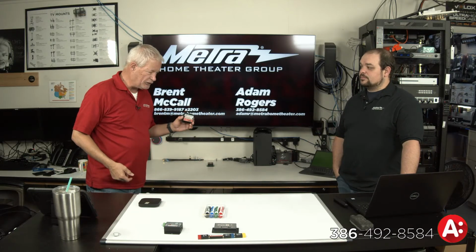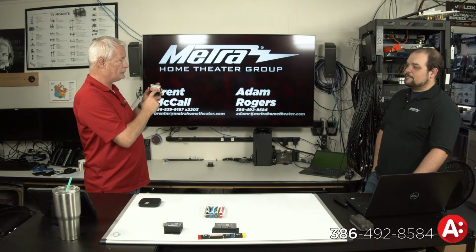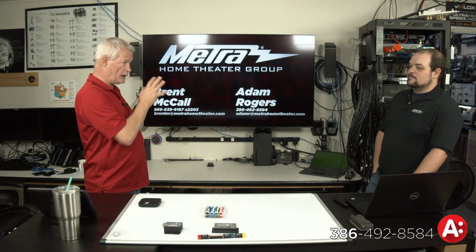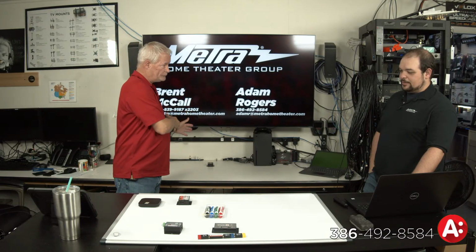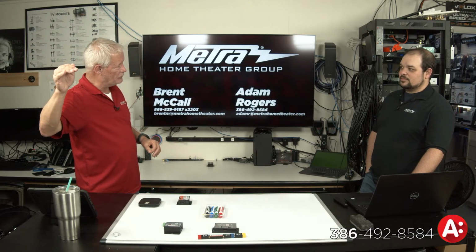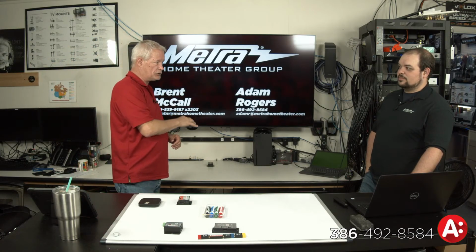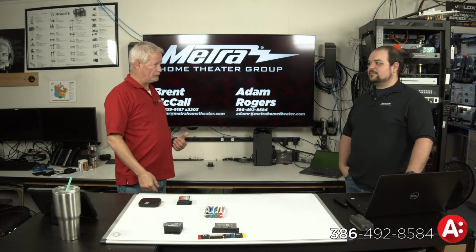Right. DirecTV, for the longest time, when you first powered up a system, all you saw was 5-volt hot plug and a little bit of activity, and then never again, unless power went off. That, however, has changed. It started with pay-per-view and now has worked its way down to a lot of the channels, where they are checking for HDCP on a more regular basis.